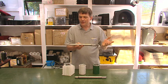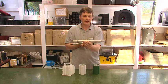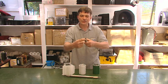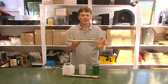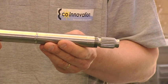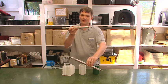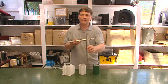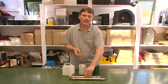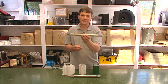Over the years the shaft has evolved from looking like that to looking like this. The only difference is that the external thread on the older shaft is now an internal thread which goes inside, which has reduced the length of the shaft a little bit, making it slightly cheaper to manufacture. The good news is you can always put a piece of 12mm threaded rod in the end to turn the latest shaft into the same style as the older shaft. We prefer the older shaft because the extractor knob that removes the Smart Drive rotor works much better on what we call the Mark 1 shaft, so if you can find these shafts, these are the ones we'd recommend.